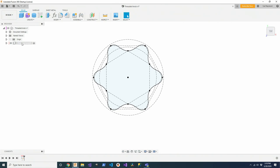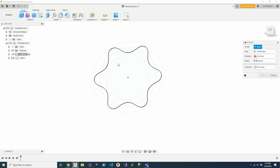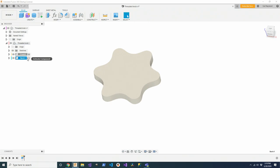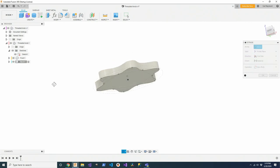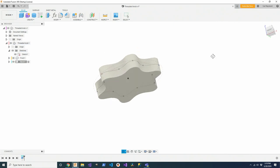We have enough to start creating some of the parts. I'm going to make a couple of new components for the front side and the back side. Now I'll do some extrude operations — first I'll activate the front, say extrude, pick my profile, and extrude that 6 millimeters up. Then I go to the back component, activate, extrude, turn my sketch back on, go to the bottom side, pick my profile and negative 6. And now it's starting to look like something.